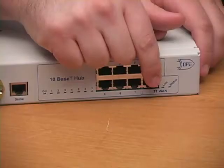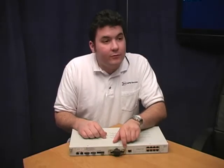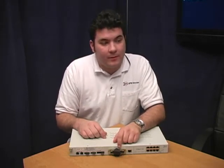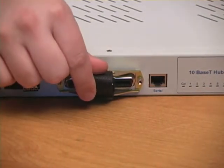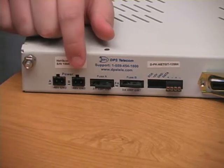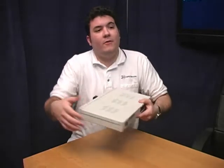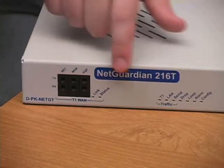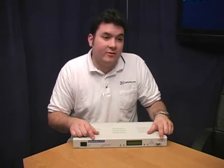Is there anything else we should cover about the 216T? Sure, I'll give you a quick tour of all the connectors. You've got the T1 WAN port and the seven port hub here. This is the terminal server serial port and up here is where the other four ports will go if you choose the five port option. This Amphenol handles the discrete, analogs, and control relays, and the Velcro strap helps make sure the cable doesn't come disconnected. These are two battery voltage analog inputs and these are the dual power inputs for extra reliability in the event of a power failure. These two are negative 48 volts, but you can also order positive 24 volts. On the front we have the Bantam Jack T1 test ports, LED indicators, an optional LCD screen and speaker for local notifications, and the front craft port for initial configuration.